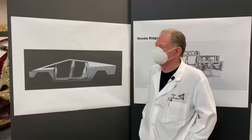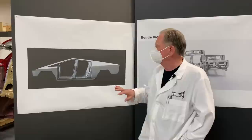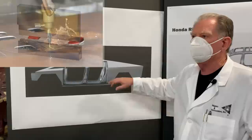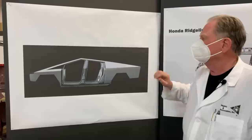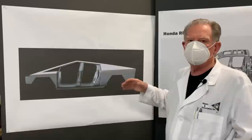Now let's talk about tooling — that's where I started out as a toolmaker working on dies and molds. You don't have to be an engineer to look at this simplistic design and think about what you'd use to make these parts. You'd probably cut it with a water jet, take the hard line and bend it in a simple brake press, and spend very little time on design development for structure, crash worthiness, and qualification. This is simple and less expensive.